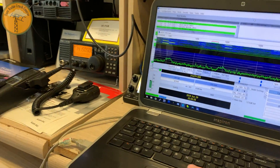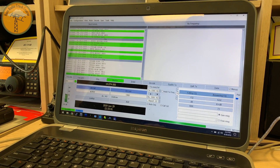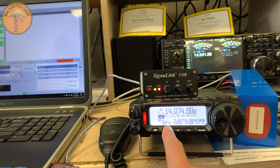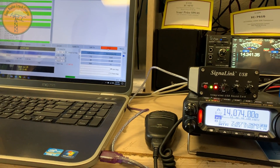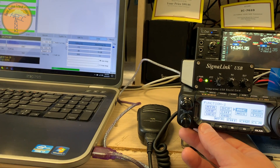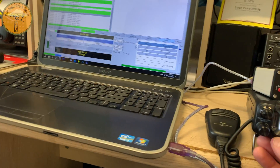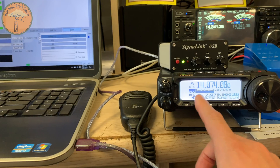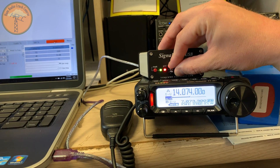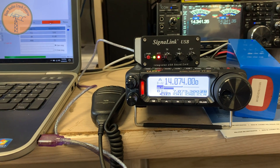Is this antenna resonant? It should be. Go ahead and hit tune. Your power output is like nil, so untune that for a second. I didn't even know you could do that. So now we want to change the meter to ALC. We're going to check the sound. When you hit tune again — nothing. Now watch — that'll turn it up. There you go. We want it right in the middle of the ALC. Now you can untune.